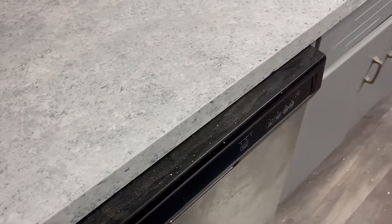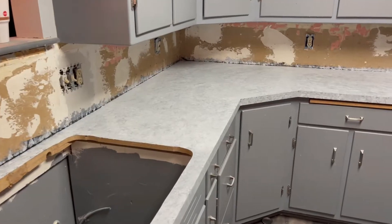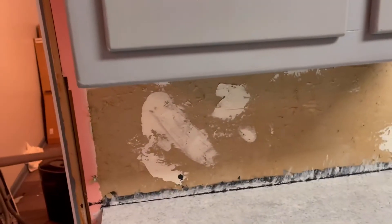It's actually a two-part step — you put one layer on, it's got to cure at least four hours, and then tomorrow I'll come back and get the final coat on. I'm really anxious to see what this is going to look like all shiny. Getting that backsplash put up will really make it look nice — finally the kitchen will match after almost a year. It goes on with a blue tint but it dries clear, so we'll see. First top coat is on — I'm going to head home and tomorrow I'll get the second coat on.